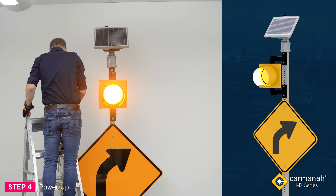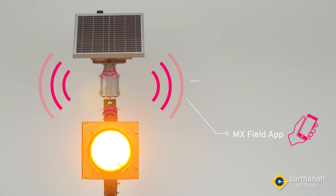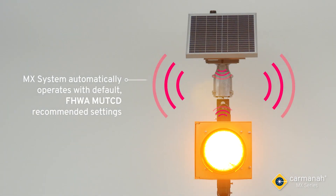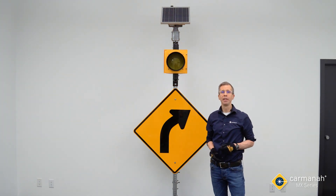Step four: power up. To complete the physical setup, we'll install the batteries and connect the battery and solar panel harnesses into their appropriate and labeled connectors. The MX system will power up and immediately form its own network, broadcasting both locally to the MX Field App and remotely to the MX Cloud. No separate process is needed to install and activate remote connectivity hardware — it's just that simple. Power up and you're reporting into the cloud. Each system will automatically start flashing with the default settings compliant to Federal Highway's MUTCD recommendations. For MX beacon modules, it will flash for 24 hours a day with a half-second on, half-second off pattern at the MUTCD recommended intensity.